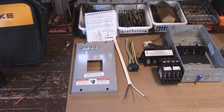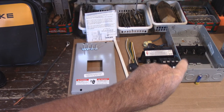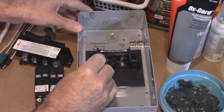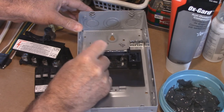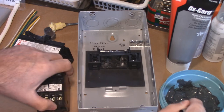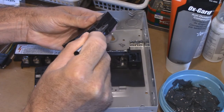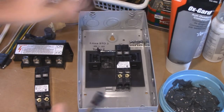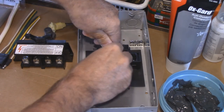Let's go over to my fuse panel. I'm going to show you exactly what I do when hooking up. I've got two breakers that will go in here. I'll show you what I do now to make sure this doesn't oxidize. All I'm going to do is just butter these two sides — these are the two main posts on this panel where the breaker goes on. I'm just going to butter that in there just like that. You don't have to go crazy with it — that's to prevent oxidization. On the back side, where it connects, I'm just going to put just a little bit in there. Not a lot, just a bit. And snap it in. Then on this side, just a little bit in there, and snap it in.